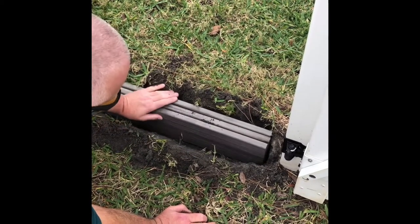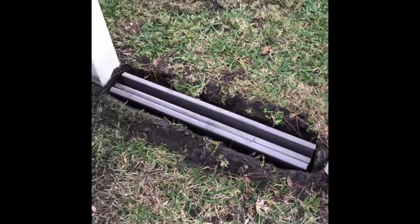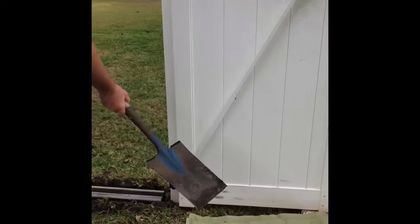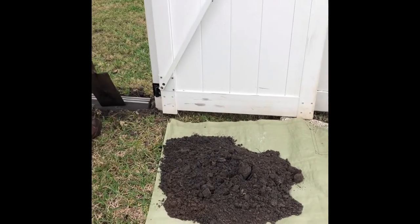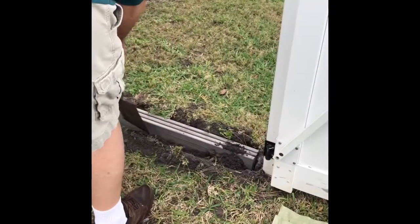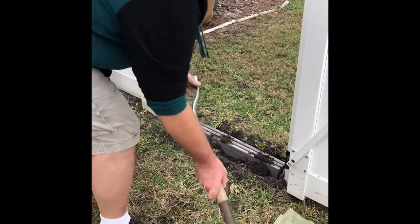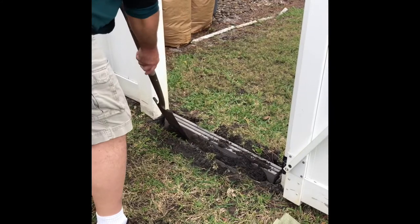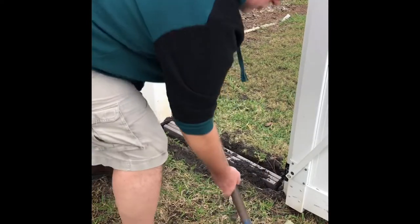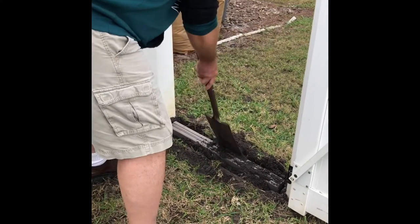You won't be able to close the gate. So now I have the three boards in there. What I will do is always put my extra soil on a tarp so it's easy to clean. Then I'll shovel some in and fill in this entire area. As I get a little bit more on this side, I'll rock those back to where I can get some soil on the far side and make sure that this is level.